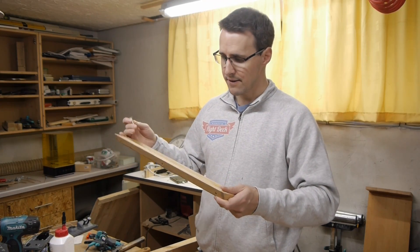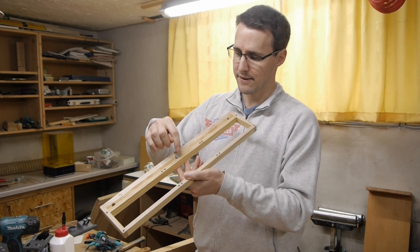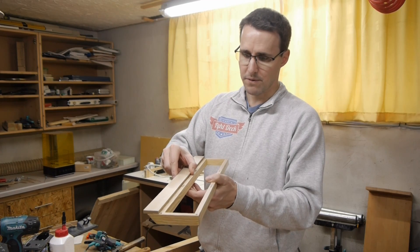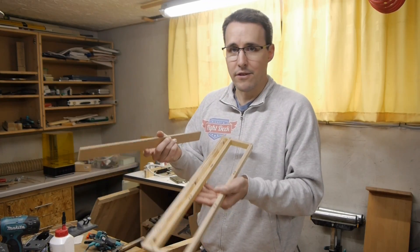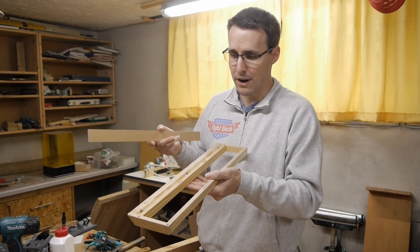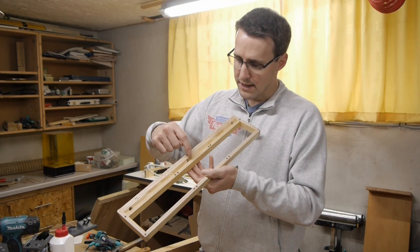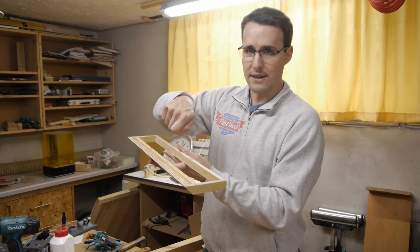I don't know exactly the length at this moment — I will have to find this out — but when I try to stick it in here the head is caught by this bar so it can't get to its final position. And later when this cover comes on top I wouldn't be able to reach this screw with a screwdriver. I know this isn't the most modular panel I have made; this screw will stay in there forever, it won't go out again. But at least I want to be able to reach the screw with a screwdriver to hold it while I'm tightening the knee panels. And so I will cut some grooves in front of this bar so I can use that groove to get in there with a screwdriver.